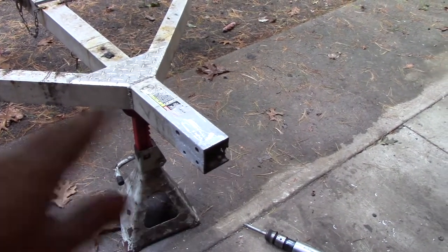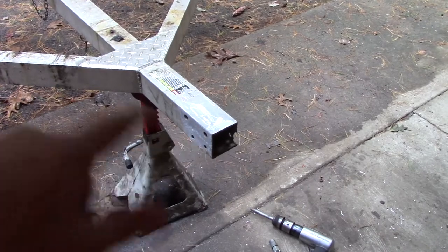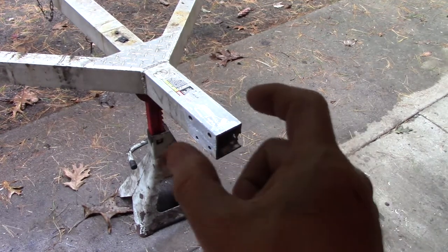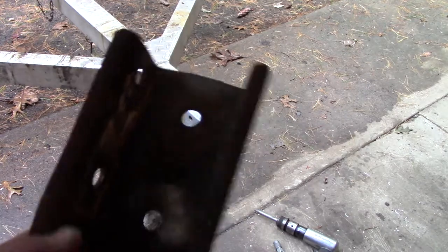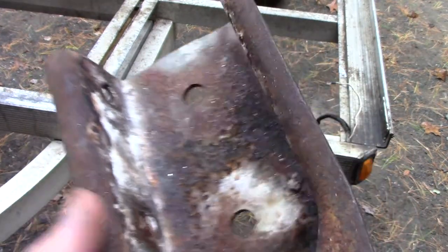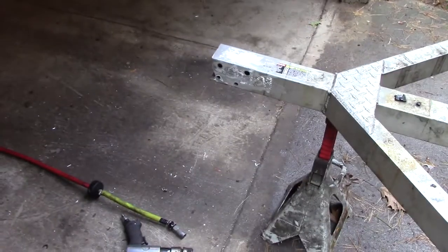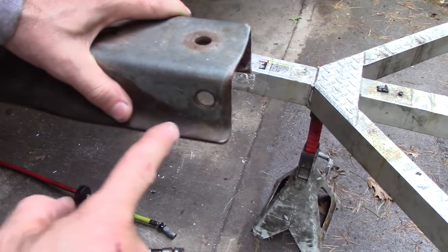This tongue - I thought it was just like the rest, just needed to clean up the Alka-Seltzer. This coupler was put on at the factory. It has the same corrosion issue - the aluminum just falling apart. This end doesn't look crushed - the walls aren't pushed inward - but the other end was crushed in a little bit. I thought maybe the bolts were tightened too much. So I decided to get in there with an air hammer from the other bolt hole and poke it out.